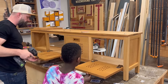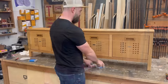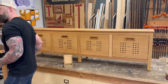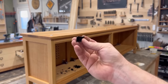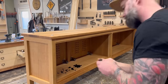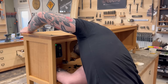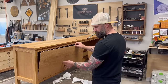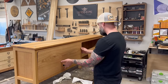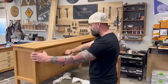I slowly worked my way down the line. I had the foreman come out just to test the action on them and make sure they were up to his liking — which they were. Before long I had all four doors installed. To secure the top I used Z-fasteners — I'd pre-drilled mortises with the domino joiner that the Z-fasteners slide into and hook the top on. Then I just had to pop my back panels in.